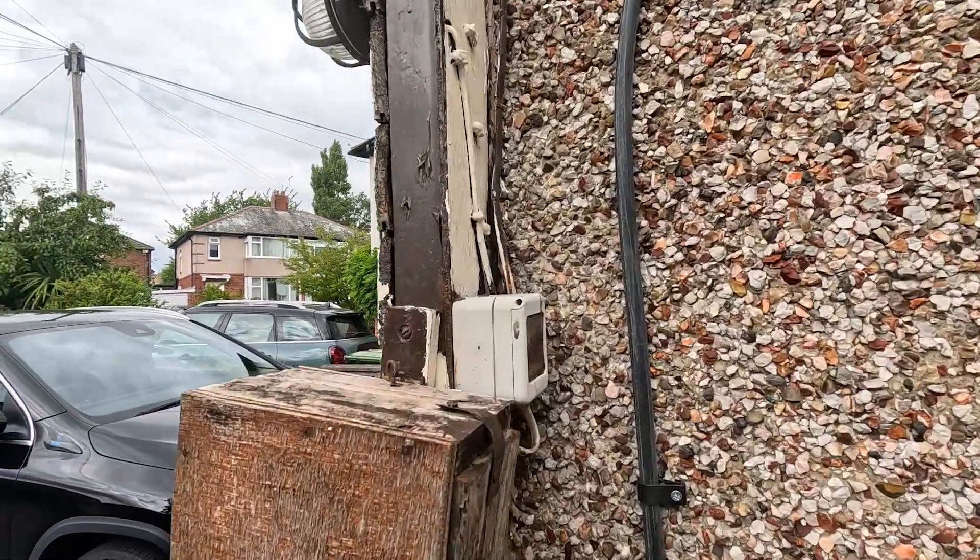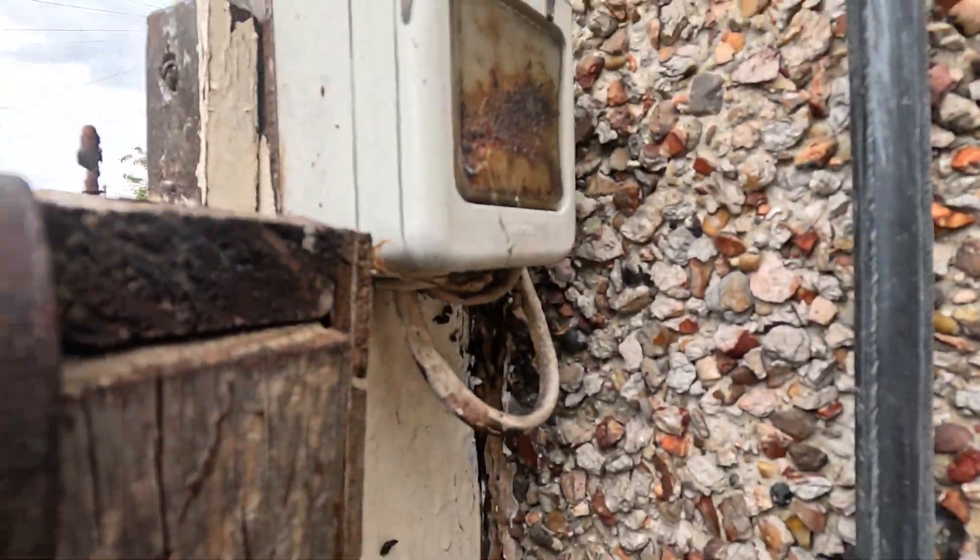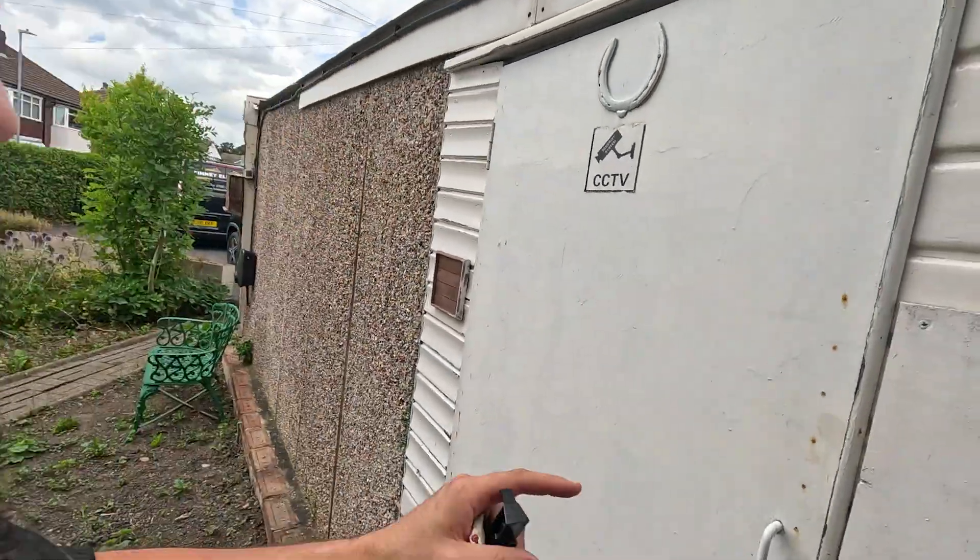That 6mm cable goes into a little junction box and then an armoured cable runs around into the garage. There's an old DIY fuse board in there with loads of cables coming in and out - not looking too great. There are exposed live conductors - you don't want to turn that on. Random switches, old fittings - generally when the ballasts go, they go with a big bang and you get a 0.00 reading. There's also a cable running into the shed. Additionally, there's a switch that looks melted, UV damage, and indoor cable running outside - you can imagine the insulation resistance on those cables after years of UV exposure.